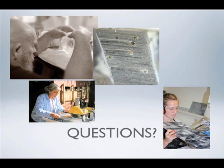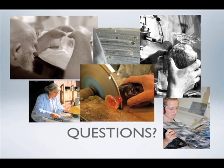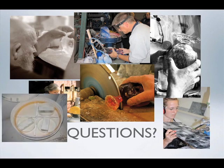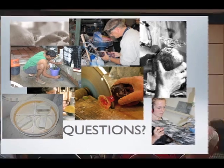The diamonds on wheels, most are electroplated, natural diamonds, engineered to break and be sharp. A diamond is very happy with force going against it in one direction. As soon as you change direction, you're changing force on the diamond, it will be more likely to break, but it'll break into a sharp edge. So if you switch direction and it breaks, it's going to essentially sharpen all the diamonds and it'll be more efficient. But your diamonds are progressively going lower every time you switch directions. I'm of a thought that I like to maintain always the same direction because the diamond does have nickel behind it, and it's stronger that way.